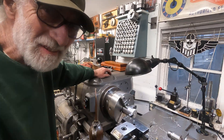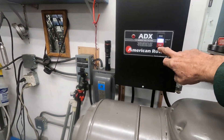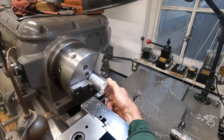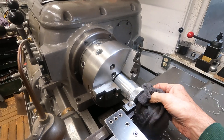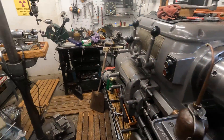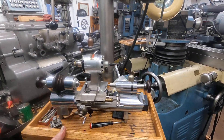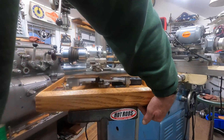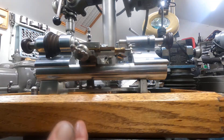I'm making a large aluminum knob here. I need a good-sized knob with a screw thread on it. I'm making this aluminum knob so I can retain this jeweler's lathe to this drill press table without a clamp — I'm afraid I'm going to knock it off. I'll mount a piece of steel underneath the wood that's got a thread, then the knob will just screw into that piece of steel and hold this all the way down. Nice, safe deal.